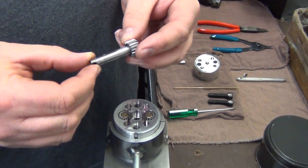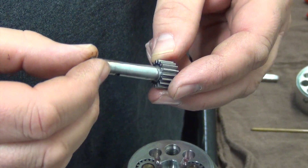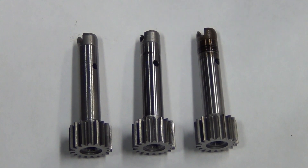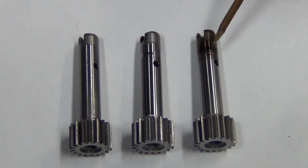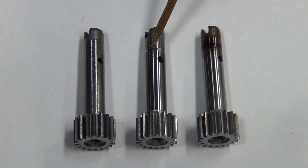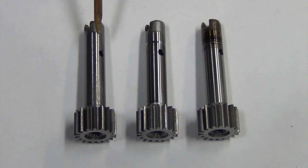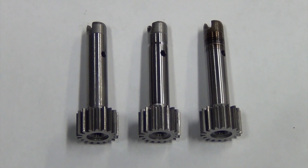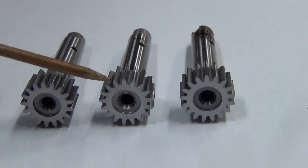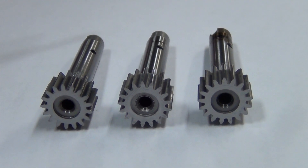On the shaft, we will be looking for wear marks where the seal area rides. We will also be checking the teeth. Here are three gears — determining bad ones versus good ones. This one has burnt marks and wear; that gear is no good. The second gear has a shiny ring — the seal has worn into the finish of the gear; also not good. This third gear has no wear marks, no patterns of any kind — that's a good gear. After inspecting the seal area, you also need to inspect the actual gear teeth. Check for any chips or debris that could get lodged inside your motor body.